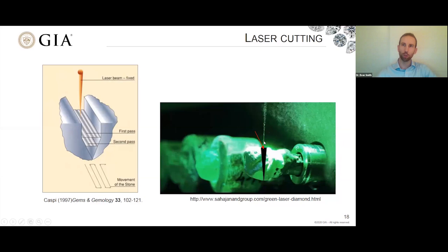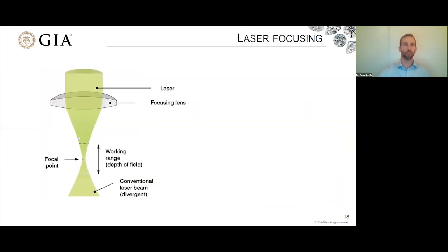The reason the laser cut has to be wedge-shaped is because the laser must be focused down to a point. To focus the laser to a point when reaching the end of the cut, you need space at the upper end where you started for the light to converge. The laser comes in focused through a lens and at some distance is focused to a small point — that's where the diamond material is being ablated. There's a strong dependence on the distance of the diamond from the condensing lens, which is a limitation of the technique.